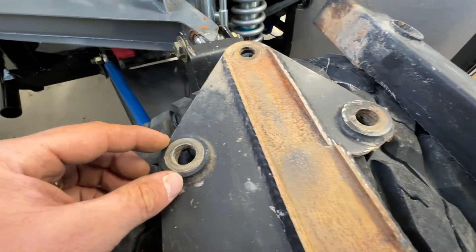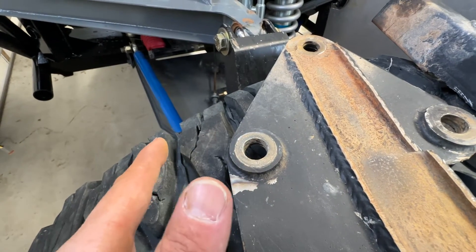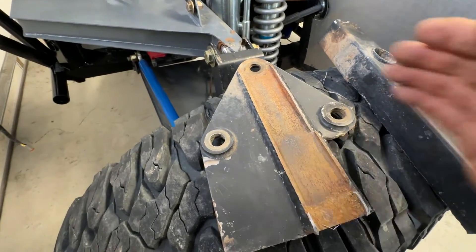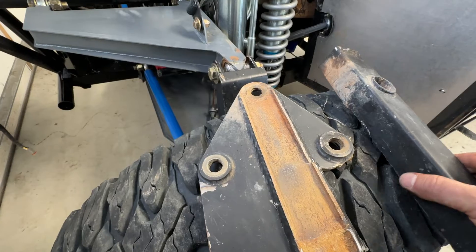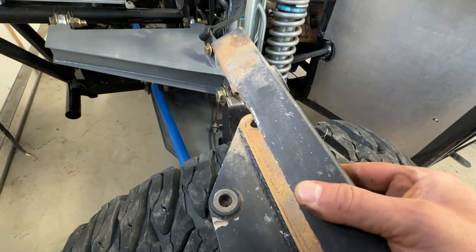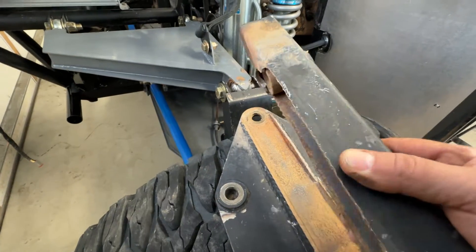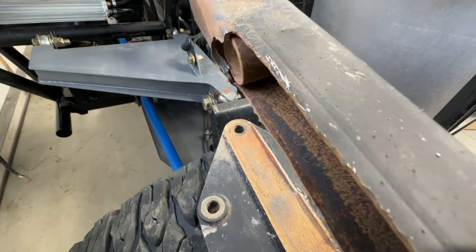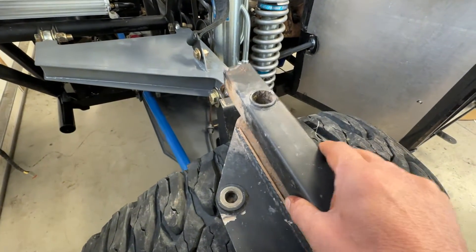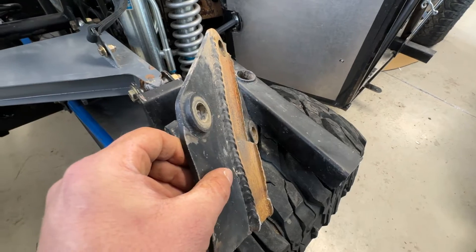Rule one: don't put a stress concentration or a weld anywhere where you could potentially create a crack too close to the edge — give yourself more distance. In engineering, they say make sure your hole is at least twice the hole diameter from the side, so it should be much further over than what it was. The square tube I used to keep the mount from moving was two-inch by two-inch with a one-eighth-inch wall. Right along the entire heat-affected zone, it sheared completely off — once that crack started, it unzipped itself and completely came apart. This thing made it 1,198 miles before it completely gave up the ghost.